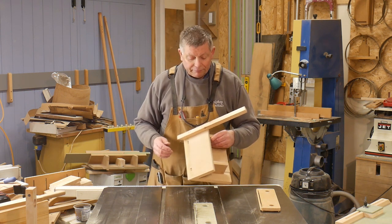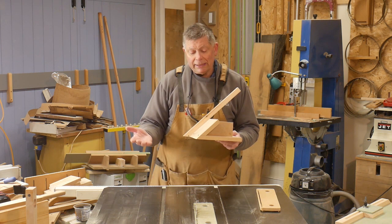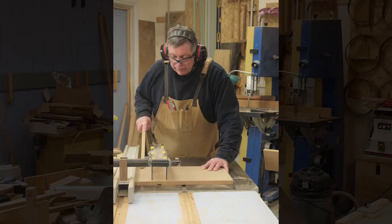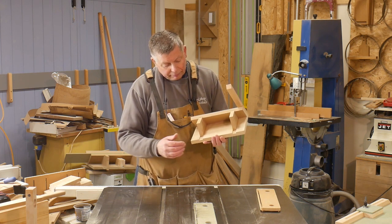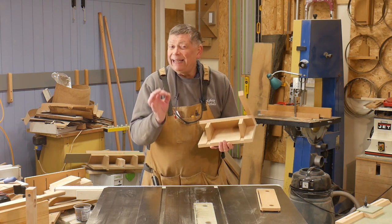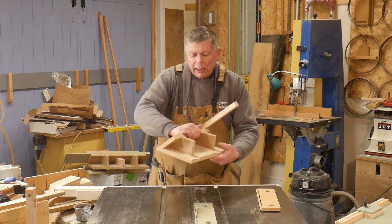To build this jig I started with a piece of MDF — about this big — so that I could route two grooves. In fact I did them on my dado set, which I don't often use on the table saw. Two grooves to take a pair of brace brackets — fillets, whatever you want to call them. That way I know this groove and that groove will line up exactly; I haven't got to force things together. They go together beautifully because they were originally part of the same groove.